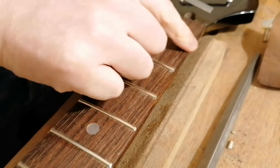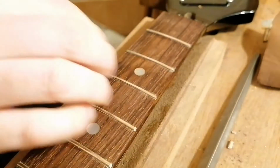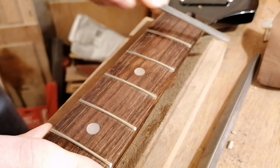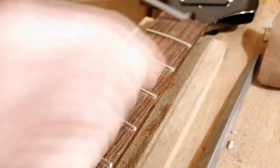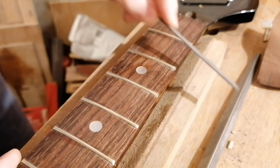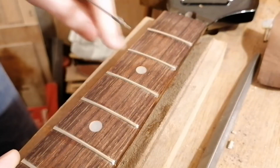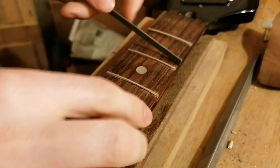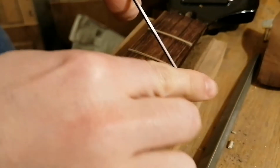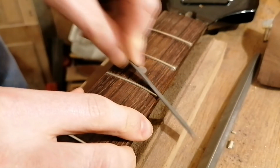Just another quick thing for taking care of sharp fret ends. Got this file. This edge is completely smooth. And just round over. I'm doing this before polishing because then I can polish up the actual U-bit, and I might do it after polishing again depending how I'm feeling, if polishing the fret ends while I'm doing that actually resharpens any of these corners. I just quite like that. Again, because this has no teeth on it, it's not biting into the wood.